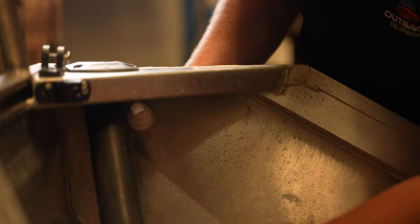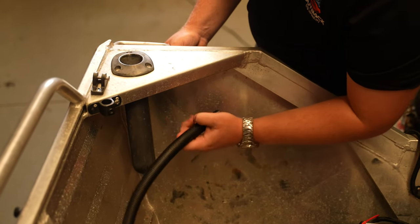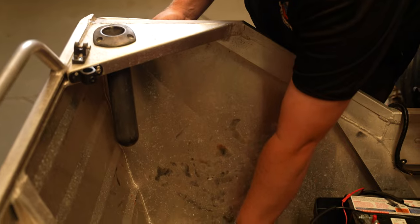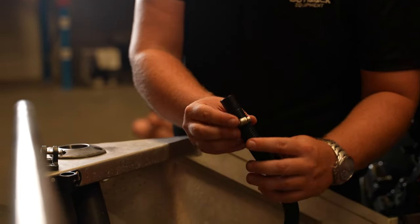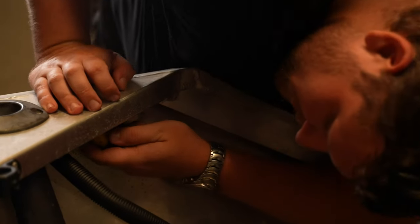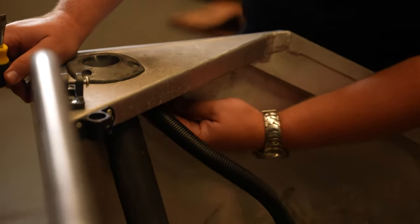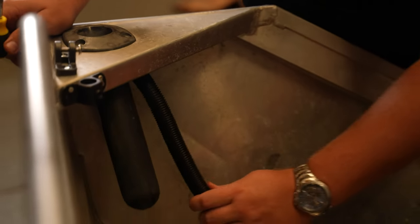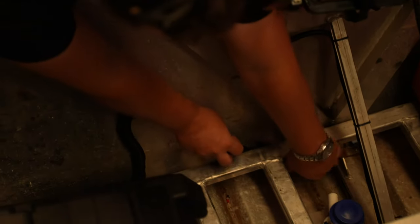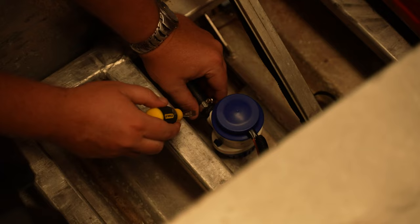Now that's the skin fitting installed on the other side. Once we've got it lined up, we've chosen to position it at the top of the hull. We want to run the hose from the top of the hull shape, underneath the ribbing, straight to the bilge pump. Once you've installed your skin fitting with your bilge hose, grab your hose clamp and fit it on the back end of the skin fitting. Tighten up the hose clamp, then cut the required length and thread your bilge hose to the bilge pump side, doing the same with the hose clamp.